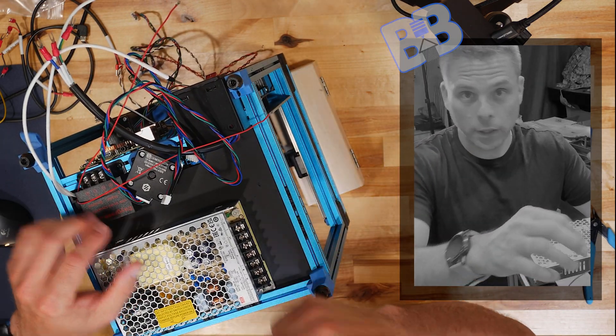This unit has an in and an out — definitely hook up your 12 or 24 volts on the input side, positive to positive and negative to negative. One interesting note on this unit: the negatives are common on the inside and the positives are on the outside, so the layout is red-black-black-red, not red-black-red-black.